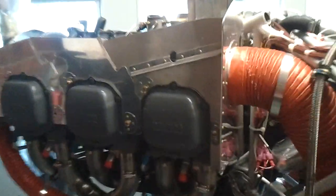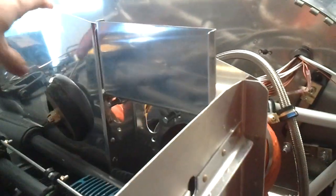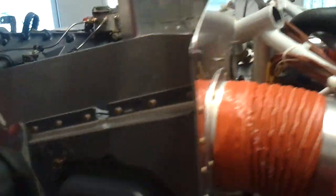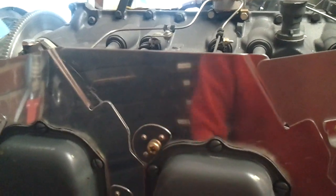So first of all, the baffling — you put together mostly the back cylinders here, five and six cylinders. Those are the ones that require the most work with this baffling stuff. You kind of create these, but the rest of them are not a lot of work. You just put these little things on them and trim them up a little bit. So the baffling is pretty straightforward in that part.